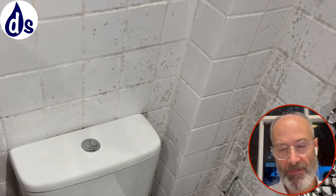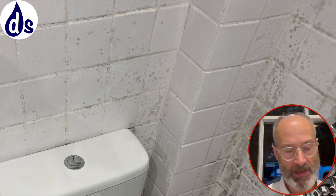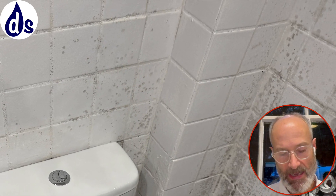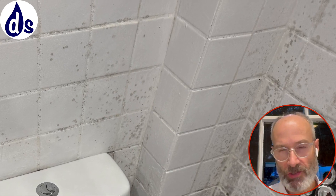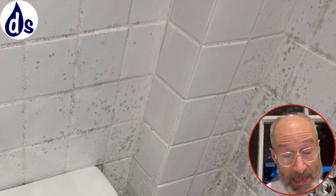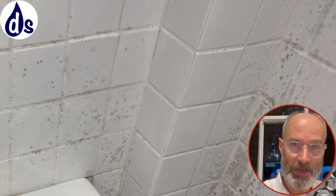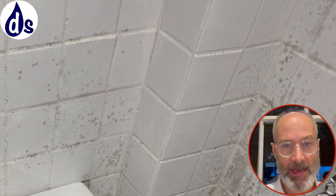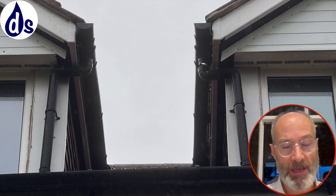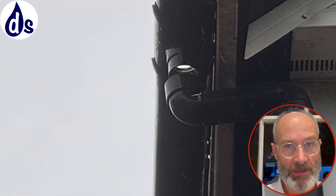I wouldn't use a fly wire mesh like that - I'd just use a flap system, with as few obstructions as possible. Obviously, fit a kitchen extractor fan and use a dehumidifier. Drying clothes internally without a dehumidifier is, I'm sorry to say, asking for vapour to migrate from the damp clothes to the cold wall, and that's what's happening here. No major structural problems overall. Please add any comments and subscribe for the next video.